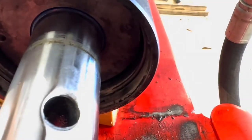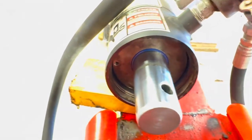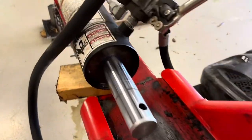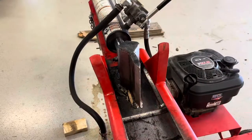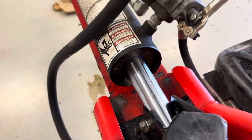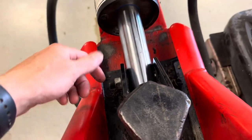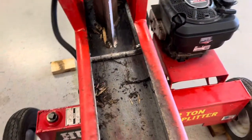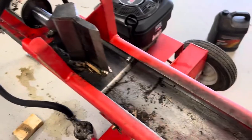The ring is back in place in the groove where it's supposed to be. I turned it back on, pushed the plate back out, and put the Phillips screw back in its hole. That did it — the plate came right back up to the ring where it was before. I lifted the arm back up, got the screw in, slid the wedge back underneath, held up the cylinder, put the bolt through, and used the three-quarter socket wrench and crescent wrench to put that on secure. We're ready to roll. I'm going to top off the reservoir with hydraulic fluid.